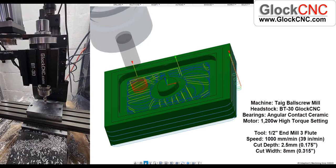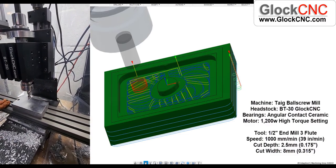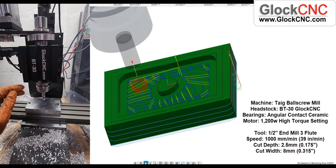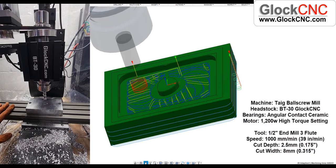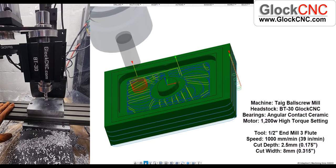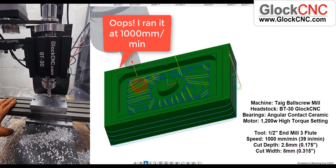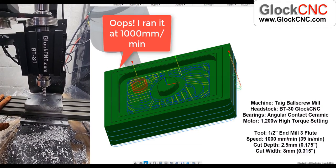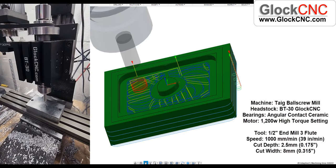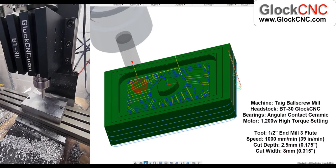The TAG Mill is actually a pretty robust little machine. I did have to invest in a slightly different nut on the back for the column for a little better bite — otherwise the column would tilt just a bit, but that nut solved it. If I have to stop the camera, I may need to lower the speed or brush chips away. If I remember correctly, the cuts in this pocket were running anywhere between 300 and 400 millimeters per minute. We've spun up to about 7,800–7,900 RPM with the half-inch cutter.